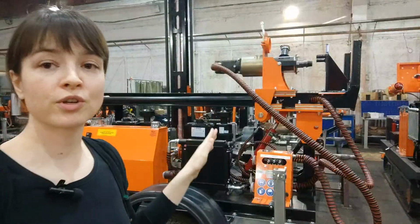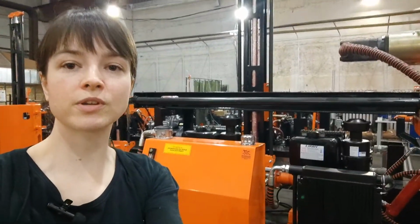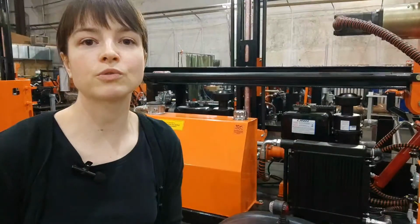So I confirm it to you guys. If you have any hard rock, just granite or any other hard formations, the GBU-30L can handle it. So we have wet drilling, air drilling with the compressor. Then we have some tasks for geological exploration. In this case, let us move on a little closer. The GBU-30L can drill with core or auger pipes, and I might show you them a little later.